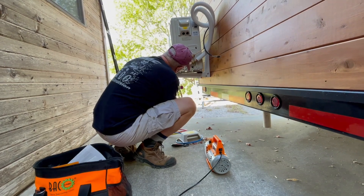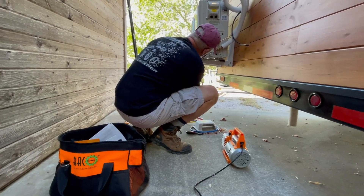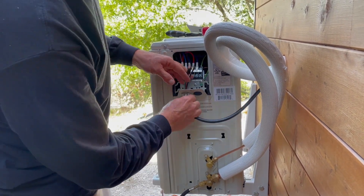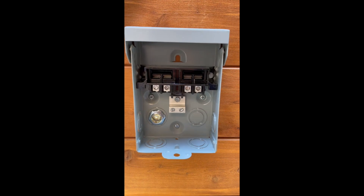Vacuuming is a really important step for a DIY mini split — you want to vacuum all the air out of the copper hoses so you can then charge everything up. We waited 20 minutes for the vacuum to run. During that time we finished wiring the connection from the interior to the exterior unit, remembering the white-red-black ordering. After 20 minutes we set a 5-minute timer, turned off the vacuum, and made sure everything stayed stable — no leaks or anything unexpected. Once those five minutes passed we were clear, and we were ready to give power to the whole unit. The kit came with a connector box installed next to the exterior unit, and the last step was using an allen wrench to release the charge to the exterior unit.